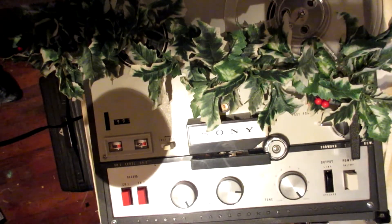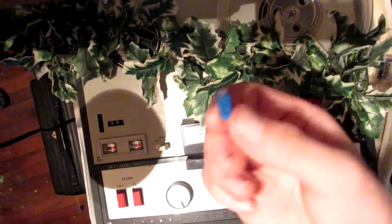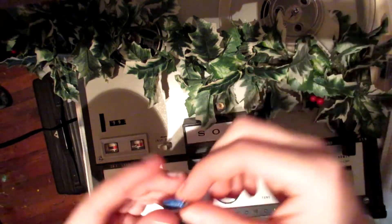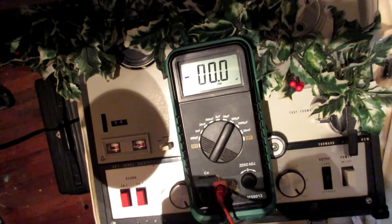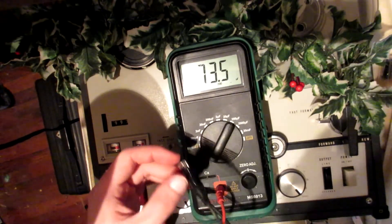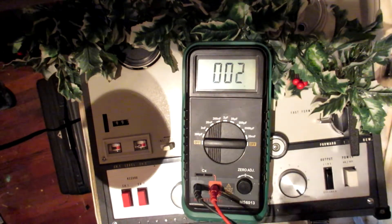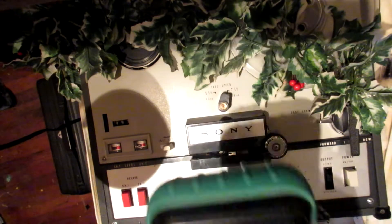Sweet, got two 47s on it. Let me desolder this, work my magic. Just like that — capacitor, nice and desoldered. It is a 47UF. Let's test it. It should be good because this battery charger was working. Yep — 48. 48. Perfect. That's a healthy cap. And I got the other one too, because they're free.